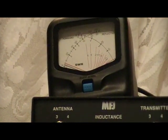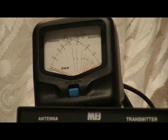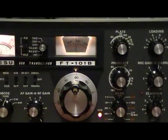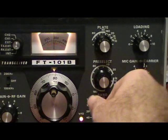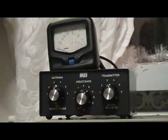We're going to go to our power meter and see where we're at. Again, 10 seconds is about all you need. At half power we're only putting out about 20 watts, and you can see the SWR is a little high — no problem. We're going to watch the power meter and tune the pre-select for maximum power reading on the meter. Hold the mic in for about 10 seconds, then tune — you can see it came up a little bit.